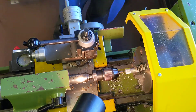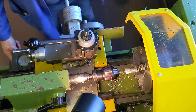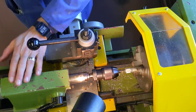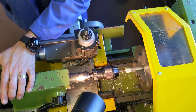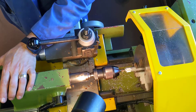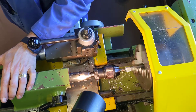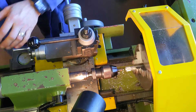I'm still on the knurling speed, so I'll bring it up to 300 RPM. When I bring the tail stock in to the 40mm mark, the tip of the cutting tool touches against the material and I can measure how deep I'm going to cut. I feed in — one millimeter, two, three, four — and I'm going to stop at five millimeters. I don't want to go in too far with the center drill.